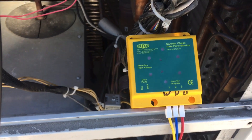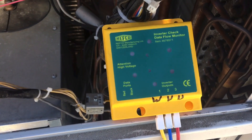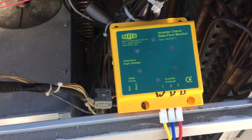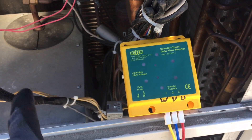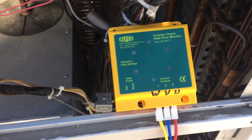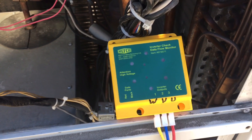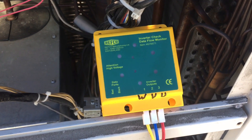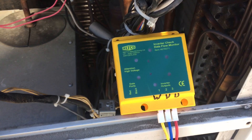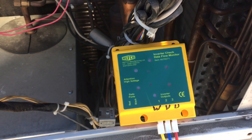Remember in these systems, every time you turn off an inverter-type system and turn it back on, they go through a self-centering and check system. It sends out a signal to a lot of the stepper valves — it literally front-seats them and back-seats them, and then comes to a middle seat, and they count their positions so they know where they're starting from before going through their mode of operation. And every time you turn these off and on to do a test or diagnose something and you have to do it many times, it's like watching grass grow.